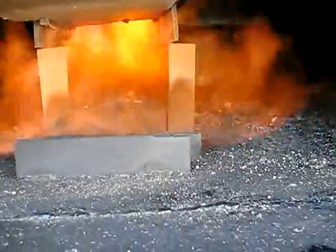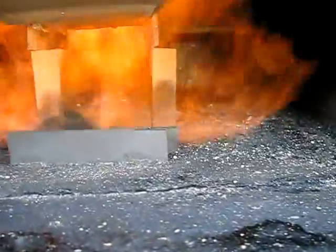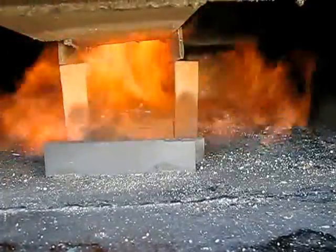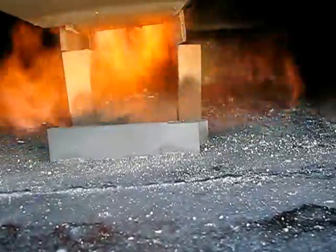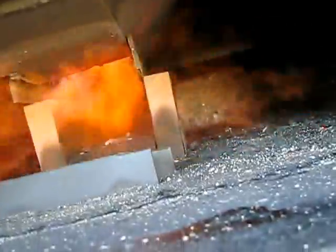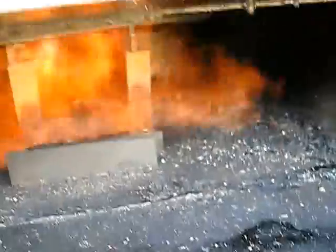Unfortunately it's not as lean as I would like - I think I need more air in there. I removed the airline that went directly into the exhaust manifold and just left a hole there so air would blow directly in, get heated up within the coals. I thought it'd ignite the burn better - it did ignite pretty quick. The steel is all orange, it's very hot in there but I think it still needs more oxygen.